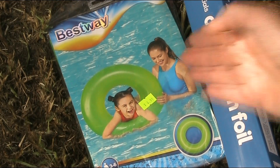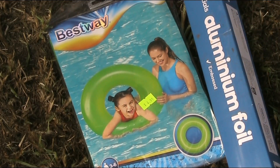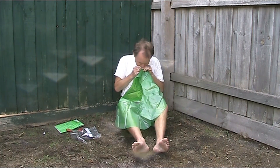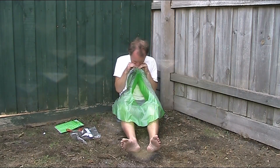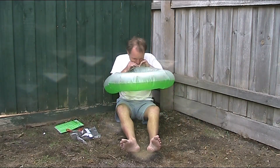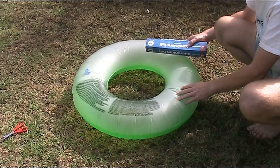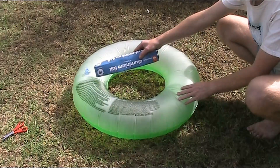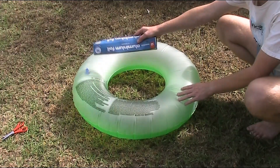The great thing about this is you'll be able to take this in your luggage, you can buy the foil at your destination at a supermarket, and then in your hotel room you can assemble this loop and be on the air. Next step is to wrap it with foil — it needs to be almost all the way around with a small gap near the top. That's where we'll put in the variable capacitor that will help tune the loop.